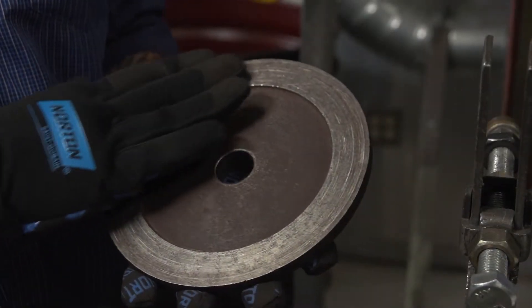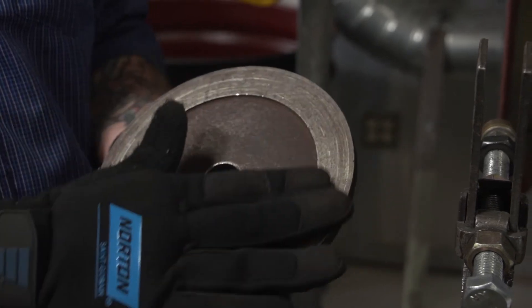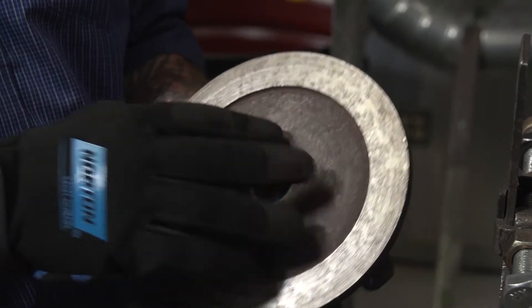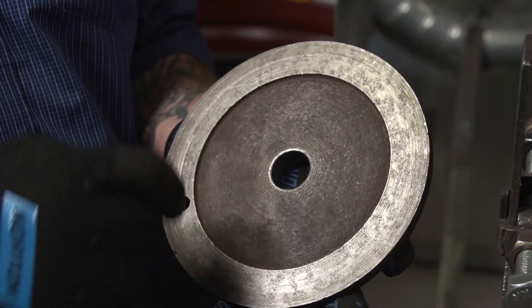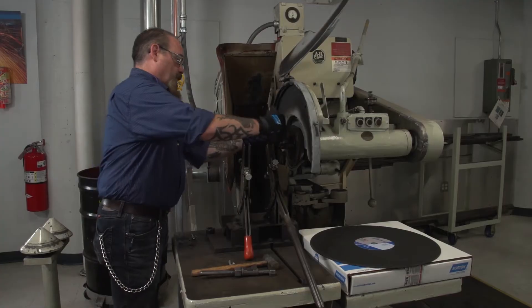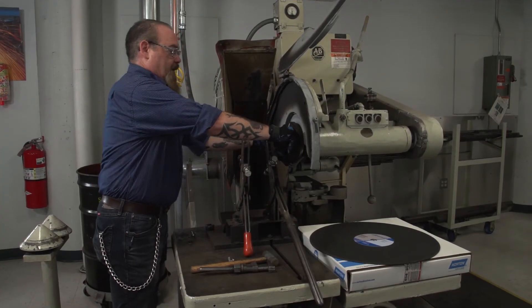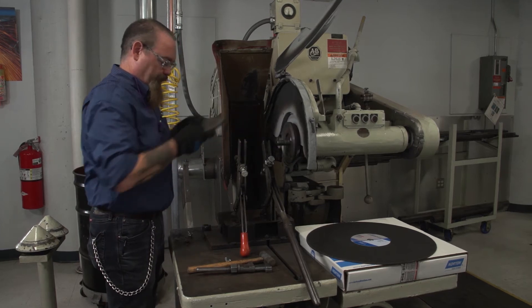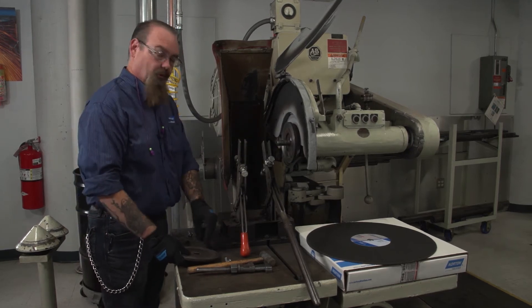You want to make sure that the bearing surface on your flanges is smooth, flat, and clean of burrs. You also want to make sure that your flanges have a recess cut out — you don't want them straight all the way across. You also want to make sure that they're both the same size, because using two different diameter flanges could put unwanted stress in the wheel.